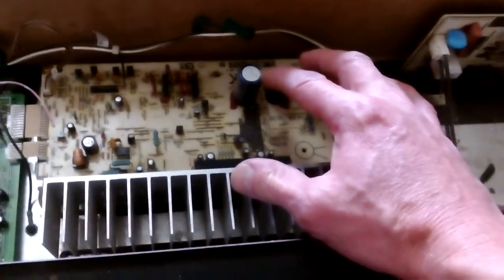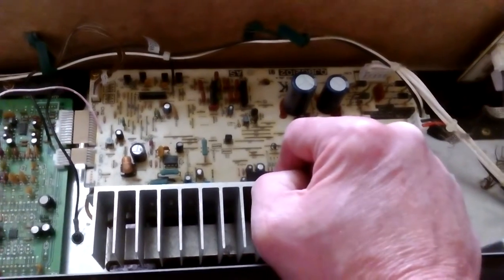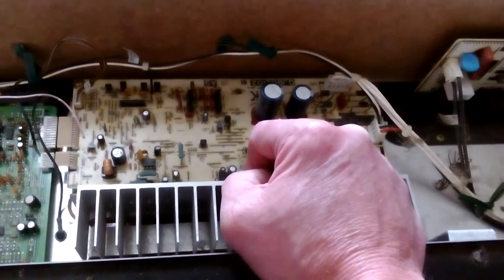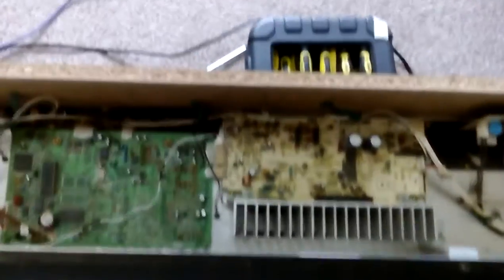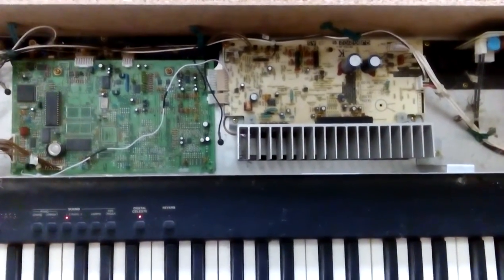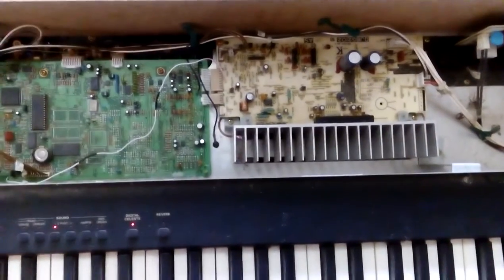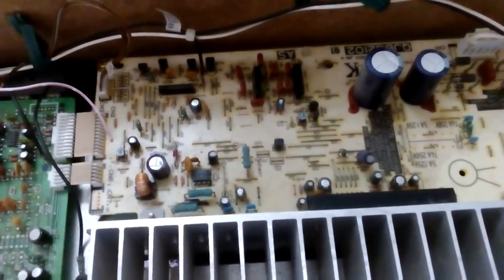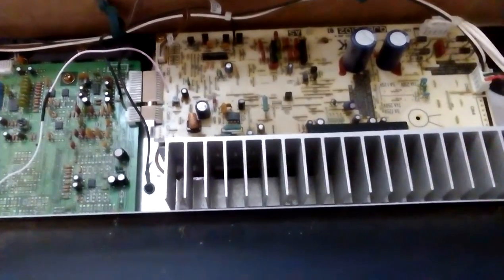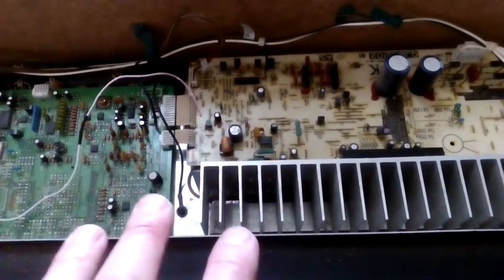There was something wrong at the amplification stage, which was weird because neither the headphones nor the main transistor going to the main speakers were working. Then I noticed another voltage called plus 15M, which is related to MIDI — it's a supply that switches on and off depending on whether the device is connected to a MIDI setup. It seemed like the unit was stuck in MIDI mode even though we didn't want it to be. A factory reset didn't work, so there was clearly a physical or electronic problem switching off the amplifiers when it shouldn't.